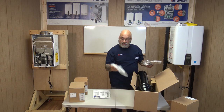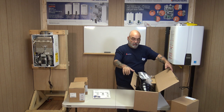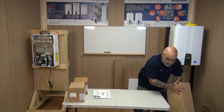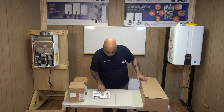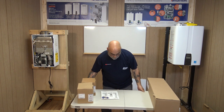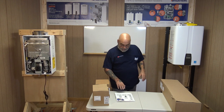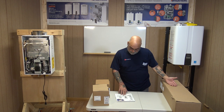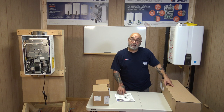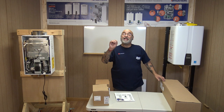You get a metal hanger that supports the piece as it comes down through the roof. All I was able to get was the 21-inch, but they also make a 33-inch. This is the horizontal vent kit — they make a 21-inch and an 11.5-inch. The 21-inch is 33.6 inches total and the 11.5-inch is 24.1 inches total — that's with the elbow included.